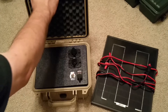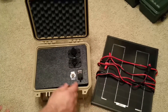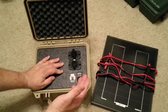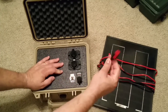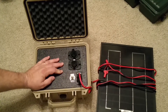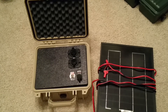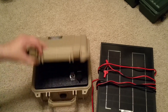It recharges via solar, which is great. If the power is out for an extended period of time, this will charge quite a few things or allow you to run lights, and you can keep it charged up. I put a NoCo Genius charger on a charging port on there, which has four charging positions so you'll know how much it's charged. The charge controller lets it float if you're continuing to charge even though it's full. I connected a 10-foot NoCo Genius extension connector, so you plug it right in, take your solar panel 10 feet away wherever you want it. This way the case may be in the shade of your porch while the solar panel is out front in the sun getting better light, and you can lower the lid to keep providing shade for the unit.